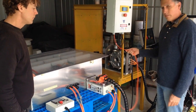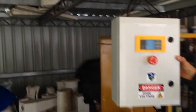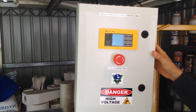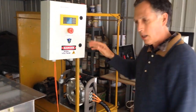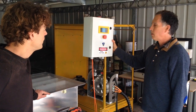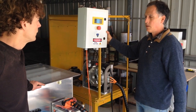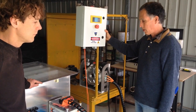Part of the project is this insulation monitoring unit. It's a safety device that actually tests all the insulation to check that everything's up to scratch. If the insulation — either the positive or the negative — makes it to ground at any point along this long length of cable (we've got about 30 metres of cable here), it's going to throw an error and trip out the power source. So is that sort of a fancy RCD? It's kind of like an RCD, except it's more sophisticated — it's proactively testing the insulation continuously, and it'll just throw an error and could save somebody's life.